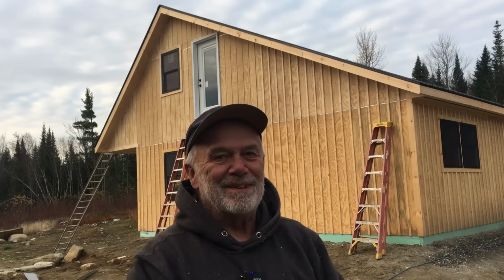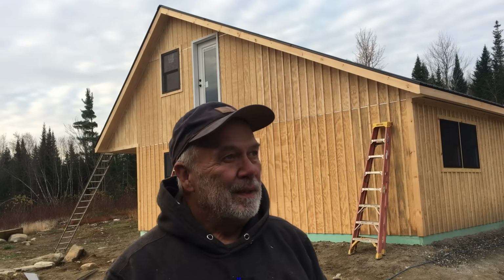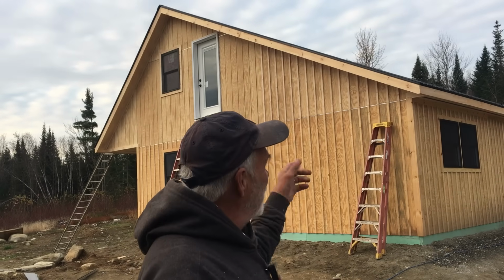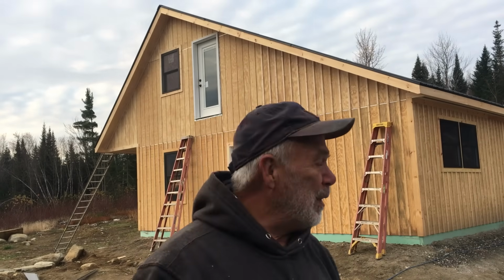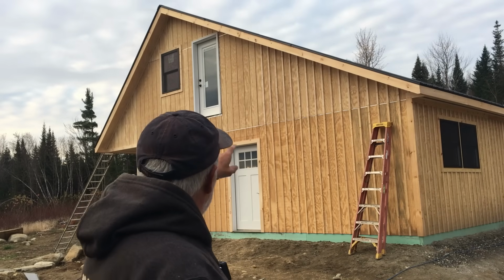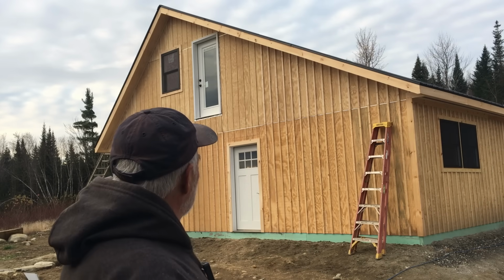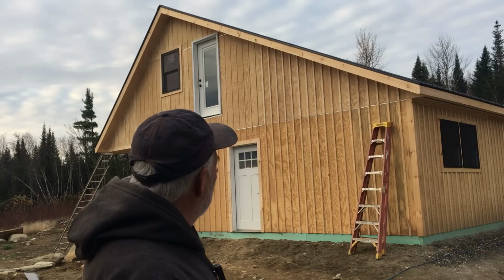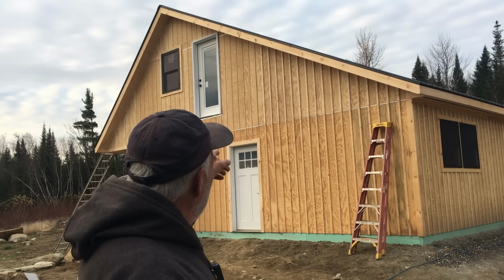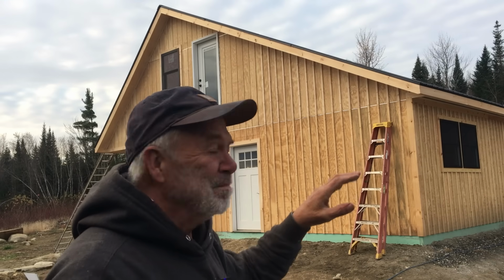Good morning. So this is probably the last video for this build. We are wrapping up a whole bunch of different things. Going to have to put on a ledger board up for upstairs for them to build a deck. So it's going to require doing some flashing work. I have to cut out some T111. We had actually started doing the battens, and then I realized that we hadn't flashed that in yet.